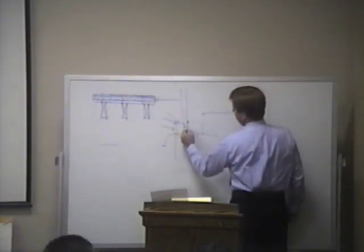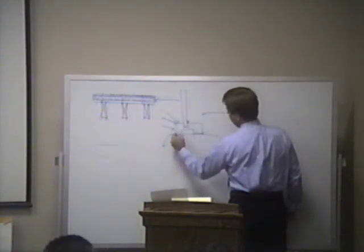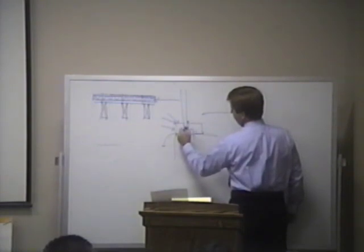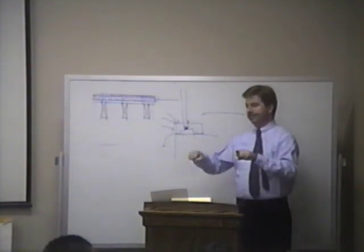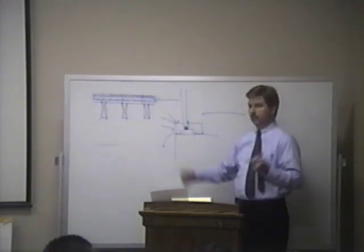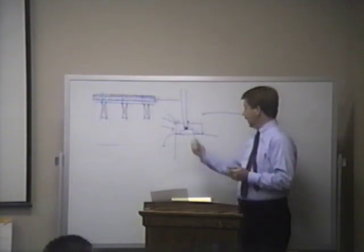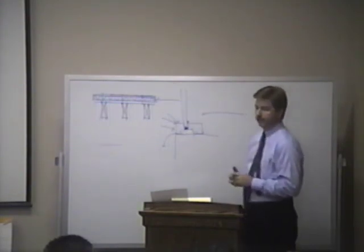Well, some of the designs they've come in with is a thermal broke frame, and there's several different configurations. They'll break the frame at this point and have it glued together with a real dense neoprene-like material, but it's real hard and dense, and it'll break that transmission that comes through. Not totally, but it's a tremendous difference. Again, that costs more. The cheapest frames on the market are what you typically see.